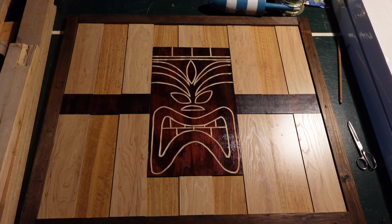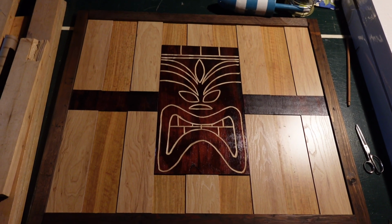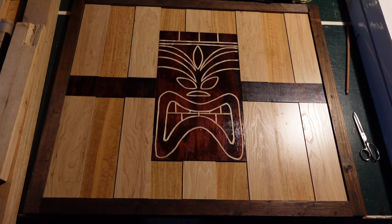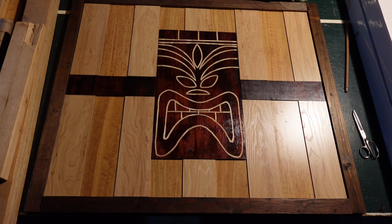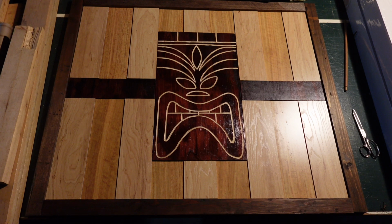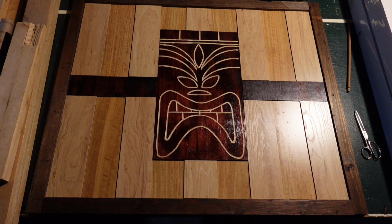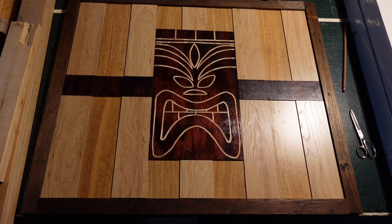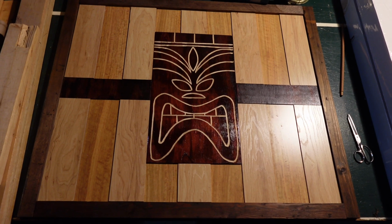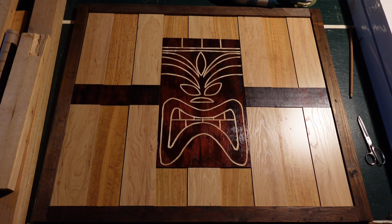And over in this corner of the basement, I have one of the panels all laid out, and it's ready to glue. I'm going to be using liquid nails on here, little bits of liquid nails to put it on to the board. I got a very thin piece of plywood on the back. And then this is going to get attached with screws to a framework at the bottom of the two display bookcases for the sides of the back bar.